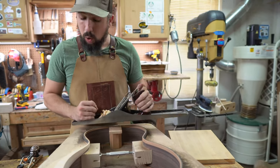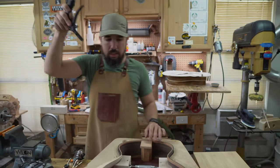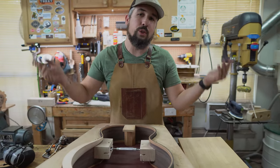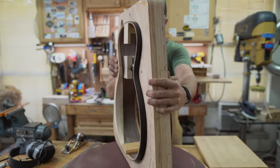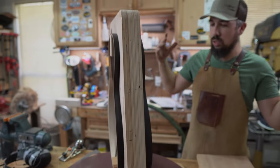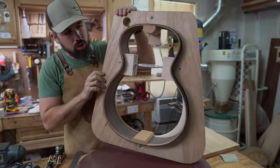I think we are there. Let's take all the dust off real quick. Everything looks really good now. This is my least favorite part, but once you're done with it, it's one of my favorite parts — especially when you use the laminate sides, because what you end up with is just such a clean look. Not a lot of braces or anything. You've got a rim that is now ready to accept the top and the back. I'll spin her around so you can get a good look at that. I'll obviously go over any little spots where there's still glue showing and get that all cleaned out.